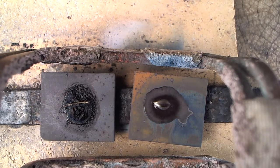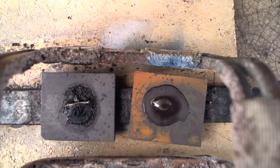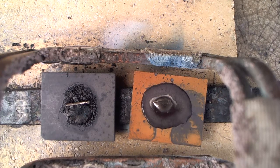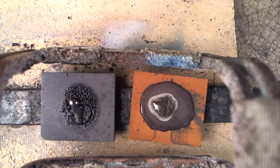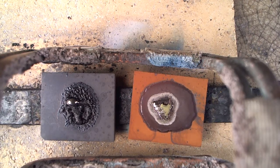This is not the perfect shape coil for the brazing — it's a real good shape for the photography. The carbide on the right is turning kind of reddish orange because I did a surface prep to it before and then cleaned it. You can see the braze alloy here: on the left it's balled up into a little tight ball in the middle. On the right, you can see it spreading out, and the first thing that happens is part of it spreads out and then you can see where there's a hump in the middle.